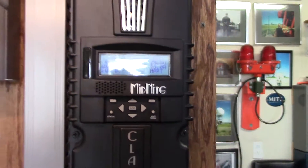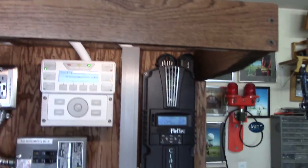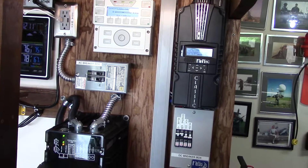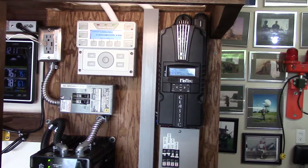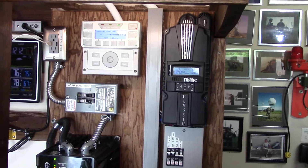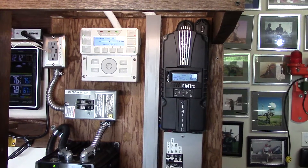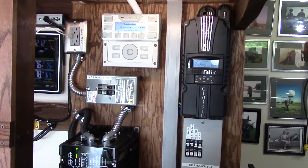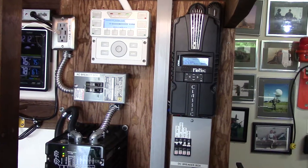What do you do when you can't make enough power from your solar panels? I've got a thousand watts there on the pergola. You've got to get more panels! So I got on Craigslist and there's an oil worker that has some industrial panels for like 150 bucks. They're 435-watt panels and he's selling them for $150 a piece. The VMP is 85 volts and my VMP on my panels out there is running about 95 volts, so it's not too shabby. I'm going to try to make a couple of those big honking panels work and wire it in here.